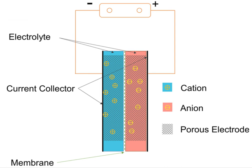The narrower definition is important for such applications, since heat increases linearly with increasing internal resistance and the maximum temperature should not be exceeded. Temperatures higher than specified can destroy the capacitor. The real application lifetime of supercapacitors, also called service life, life expectancy, or load life, can reach 10 to 15 years or more at room temperature.